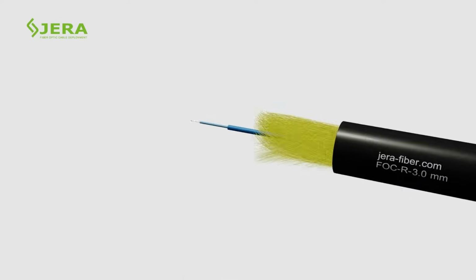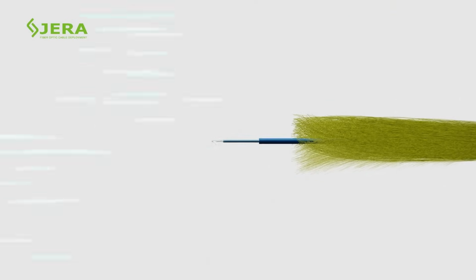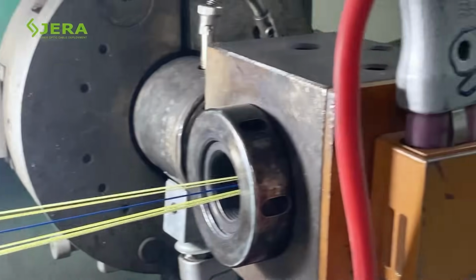The cable consists of a 3 mm diameter outer polymer jacket, aramid yarns for specified tensile performance, 0.9 mm tight buffer tube for fiber protection, cladding layer of fiber core. Fiber core of different fiber standards, like G657A2, which transfer the light.